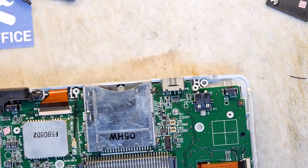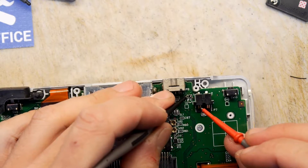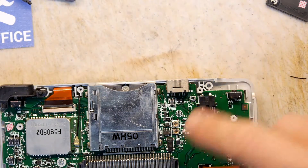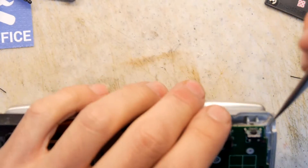So we'll get our meter again. We certainly should be seeing some interesting continuity now to the other side. Our battery is now going through. I think the power must go through the battery charge circuit before it gets to the CPU or anything — that would be my guess. If it works now, at least. If it doesn't work, we'll have to go routing a bit further.